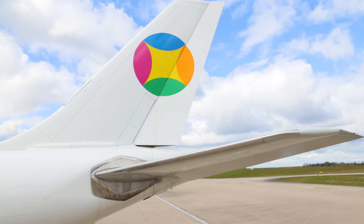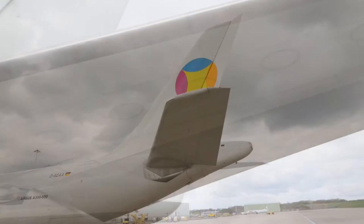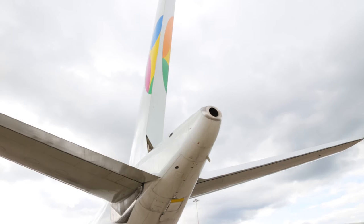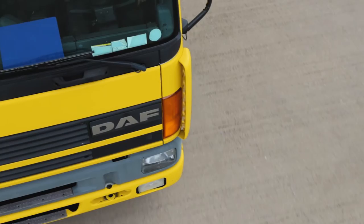Tail as well. Spray from the top of the tail and let the fluid run down. Don't overspray the tail, because most of the fluid will end up on the ramp or in areas of the aircraft that you do not wish the fluid to enter. You must never be tempted to spray from the rear of the wings or the rear of the stabilizers, because you'll blast fluid into all the quiet areas of the control surfaces. Not only can it cause flight problems, but during maintenance it can be very costly to clear the fluid and the gel that's accumulated in the quiet areas. Again, the driver must ensure that he doesn't go over grates or gullies too fast, or do any sharp turns.